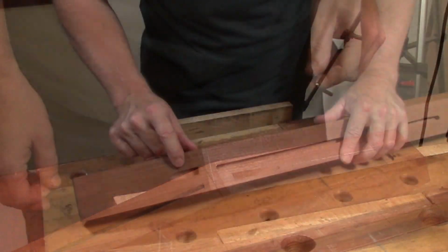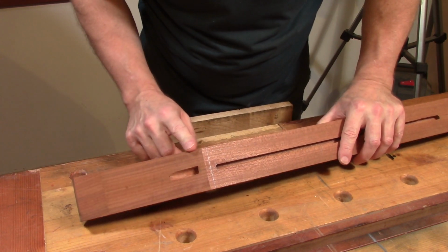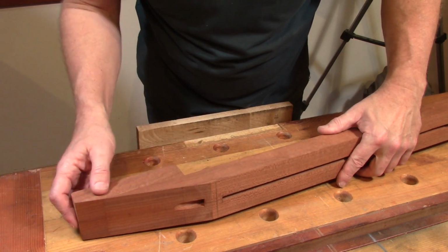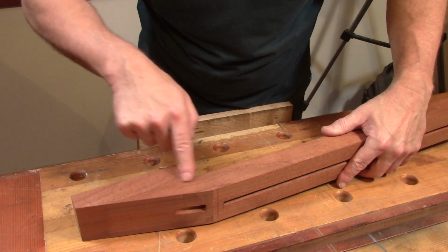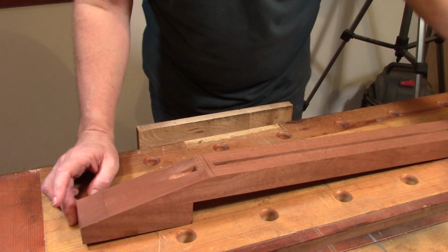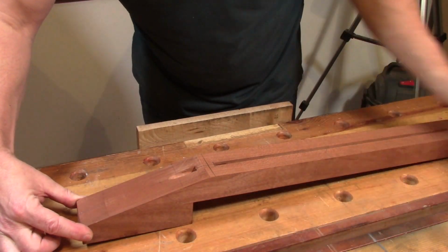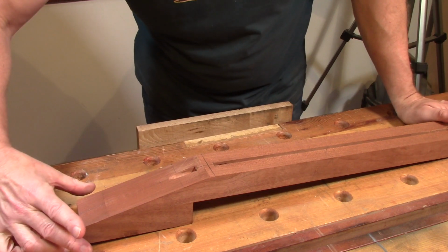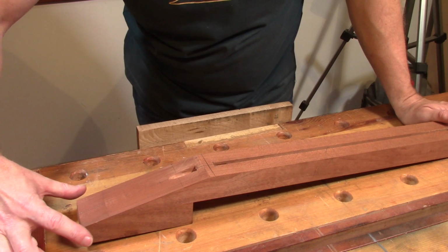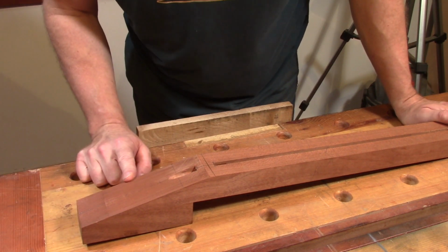So that's brilliant. So with the truss rod access cut and ready to go, the next bit is to continue with the shaping of the headstock. So I'm going to have to thin this area down. This needs to be about 15mm thick, and at its widest point the headstock is about 85mm. This is about 60, so I need to add the famous ears onto the headstock, which will bring it out to about 100mm wide, and then we can do the headstock shaping from there.